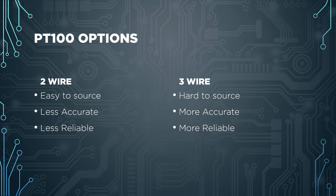There is no downside to three-wire, so if you want to be sure you can go with that. There aren't many places that sell three-wire PT100 RTDs in a V6 form factor — I'll link the AliExpress listing I bought from in the description. Keep in mind: the termination you choose doesn't really change the wire count — even if you choose two-wire it comes with a three-wire sensor. They just connect the two cables going to the same pole to the same pin.